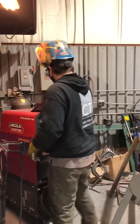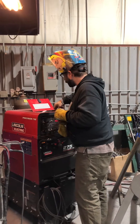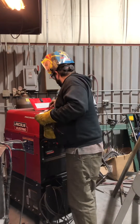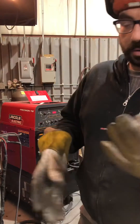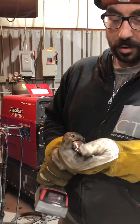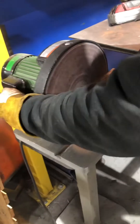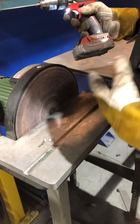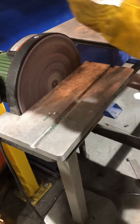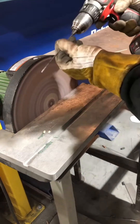For stainless, use red thoriated tungsten. Get yourself a disc sander, belt sander, or a diamond wheel on a right angle grinder — anything like that. Turn it on, go with the rotation so the grind lines run along the tungsten, so the gas comes off the tip of the tungsten right.